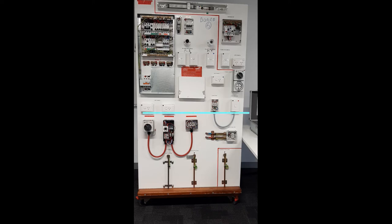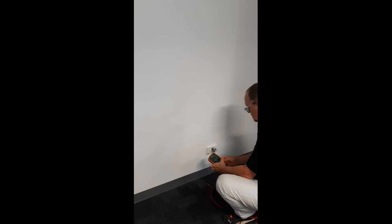This video will demonstrate how to safely perform testing for dead of an electrical installation with a metallic switchboard. This testing for dead video assumes that you have implemented the isolation procedure and isolated the power to the installation switchboard. You must first test your voltmeter on a known 230 volt AC source — 245 volts.